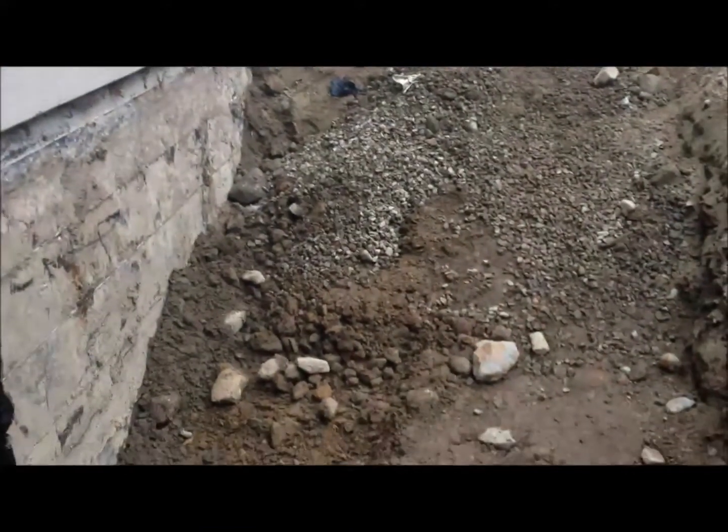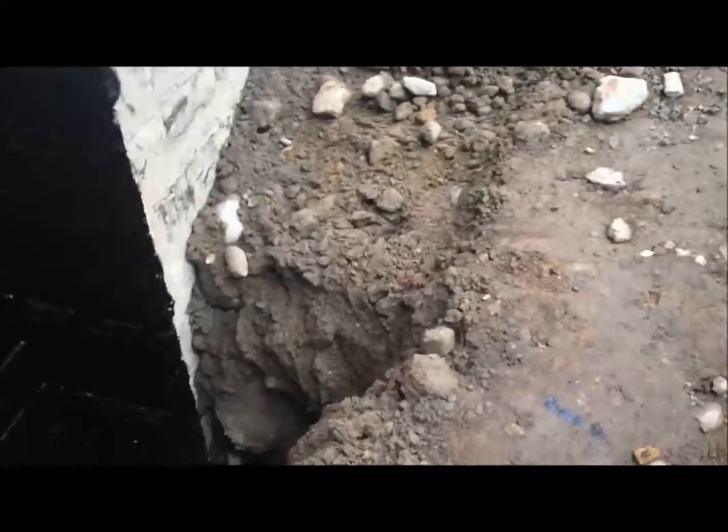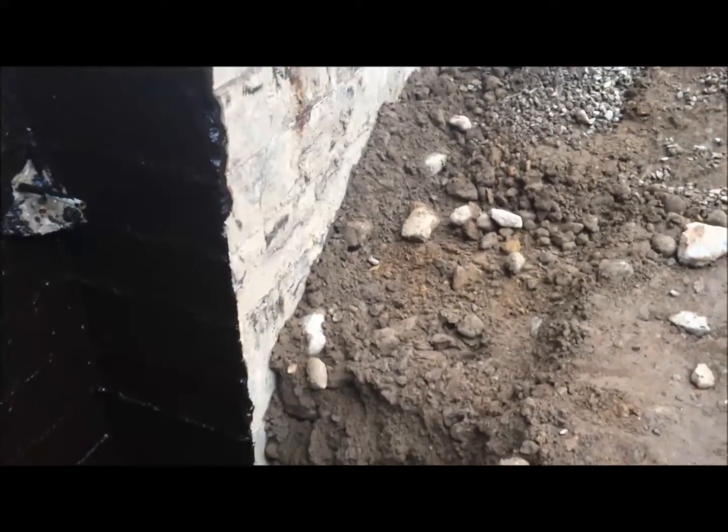When that is done, we'll have filled all this up quite a ways, then he'll dig that out another 10 feet or so. That downspout right there goes into a sump in the middle of my driveway, but below it is the kitchen and the suite underneath our ground floor — and that's where it's very leaky. I need to get all that cleaned out and repeat the drain tile exercise. I ran some water with the hose into the drain tile going around the house, and I'm going to check out the sump. The drain tile exits into the sump over here — if there's water, it's running free; if there's no water, it's jammed up. The one facing toward me — there's no water, so that means it's clogged up somewhere. We're going to get a snake and clear that clog.